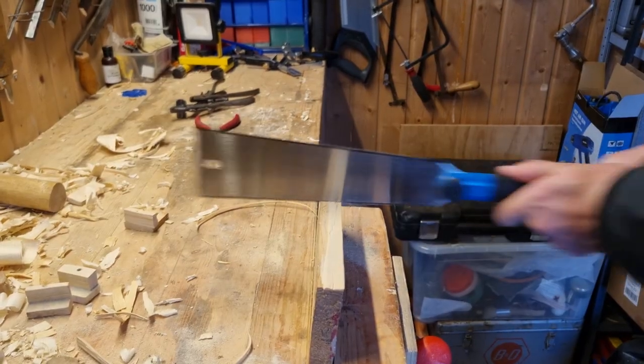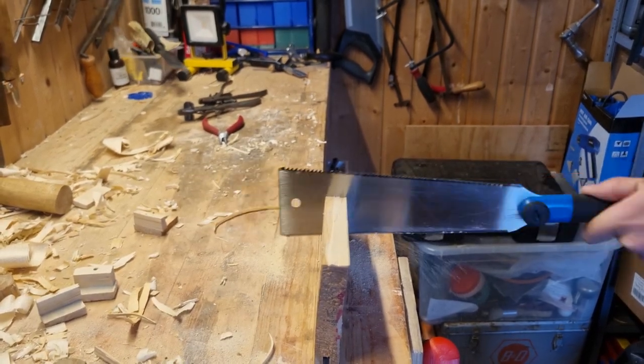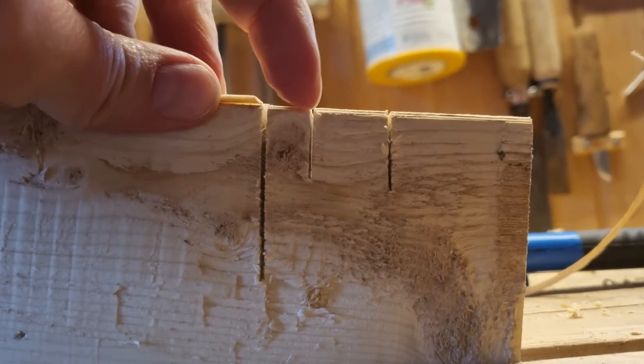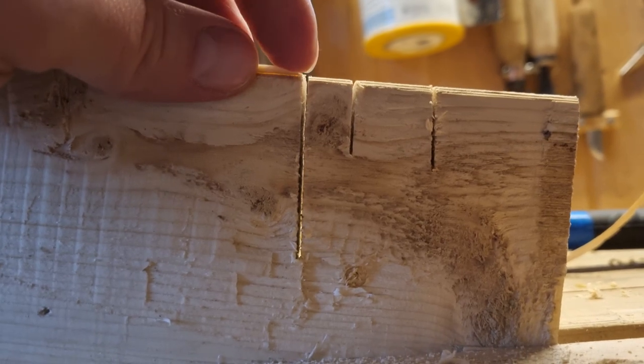Let's see if that made any difference. Visually, the first cut before I set the saw is thinner than the second cut, which is completely logical, since the tip of the teeth are further apart — that will create a bigger space for the saw. I feel like I can use this side now, which I couldn't before.